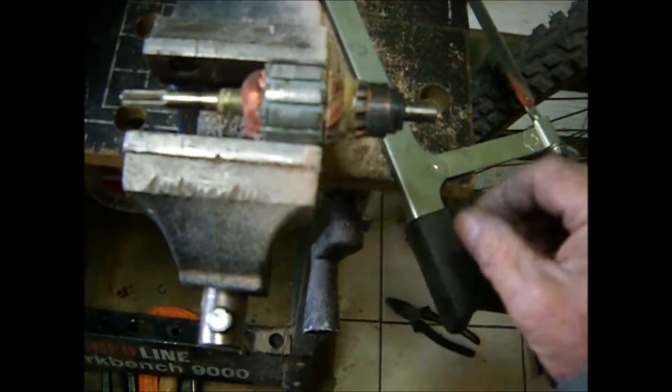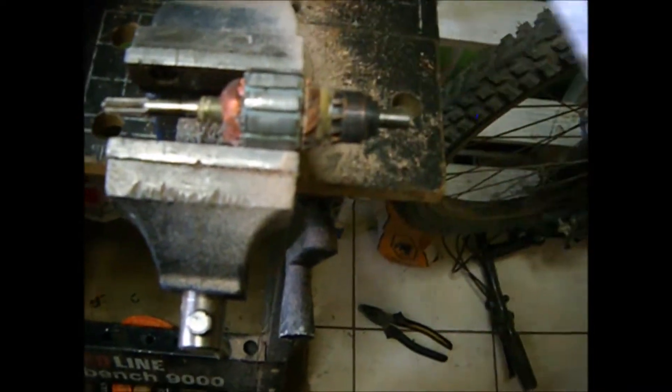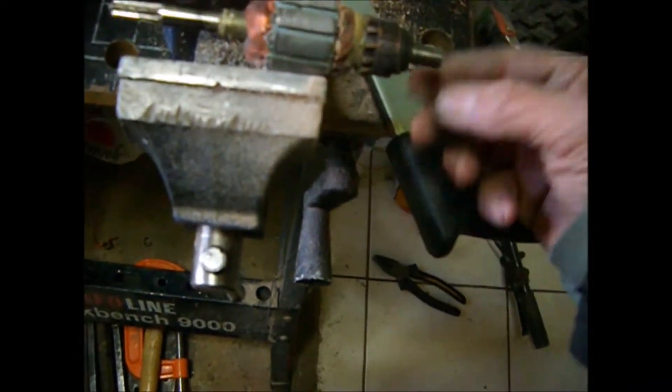The first thing we do is make a cut with a metal saw of at least 24 teeth. We make a cut all around until we reach the steel bar — the shaft. We cut here as close as possible. The cut crosses a layer of copper, then a bit of plastic, and finally reaches the steel. When the saw reaches the steel, the sawing sound changes.